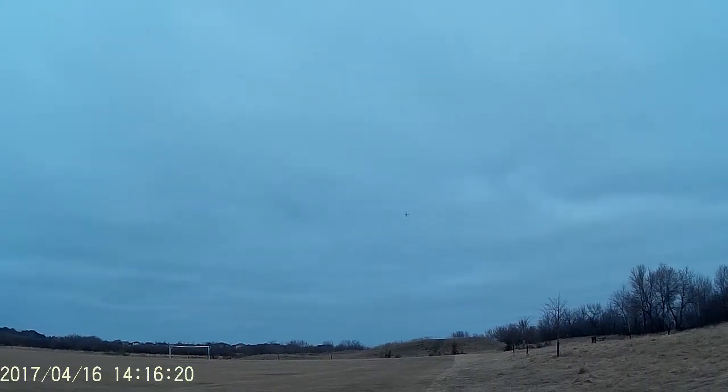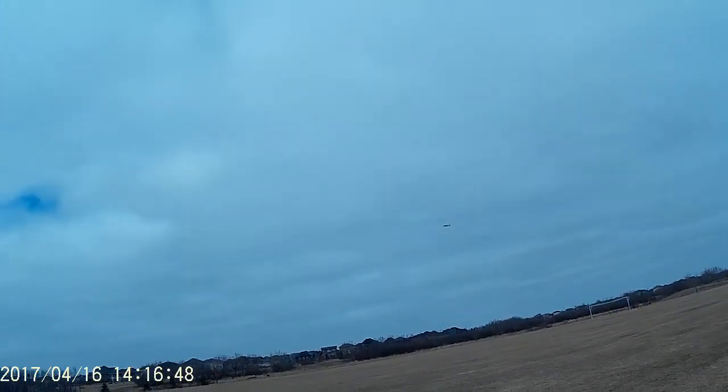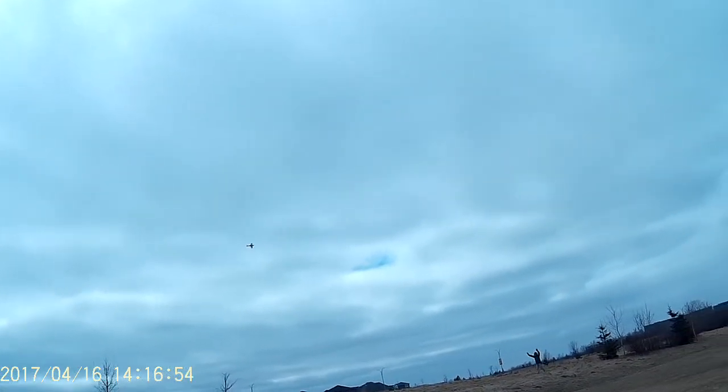That cruise is actually nice. That's full throttle against the wind. That'll sort of whip the wind. Crosswind a bit. Little 35 amp ESC in it, NTM 28-26, 1200KV, 12.5 prop, 2200 3S Zippy battery.